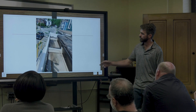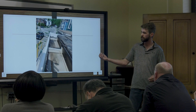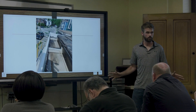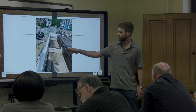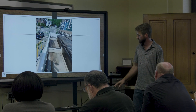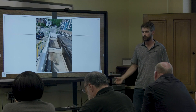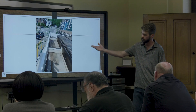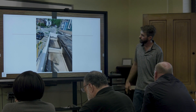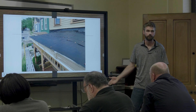Other times, like this one, we notched out the actual old rafters. They were semi-decent — not destroyed — so we notched them, put new wood alongside and sistered it. That was the fastest, easiest way for that project. Again, every project is circumstantial. This was actually a painted lady house — anyone familiar with that area.